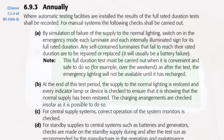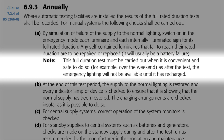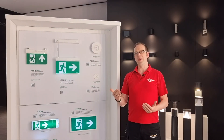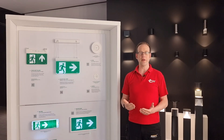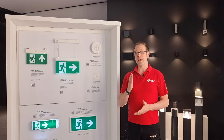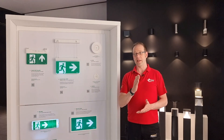For manual systems, the instruction is to simulate the failing of the main supply to the fittings for three hours and repair or replace any fittings that don't make it, usually due to battery issues. Importantly, this full duration test must be carried out when it's convenient and safe to do so — for example, over the weekend — as after the test the emergency lighting will not be available until it has recharged. If you did this first thing on a Monday and got it powered back up by lunchtime and then there was a power cut, the batteries may not have sufficiently recharged to sustain another three hours should there be a genuine emergency.